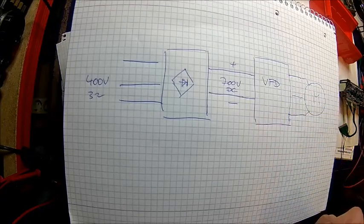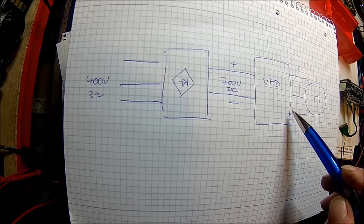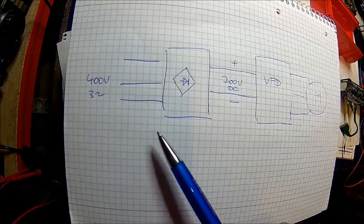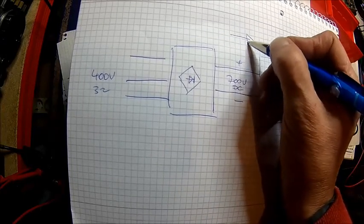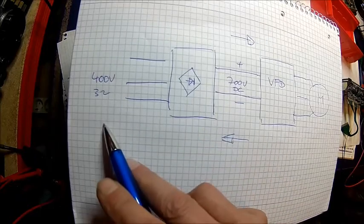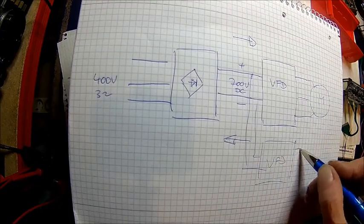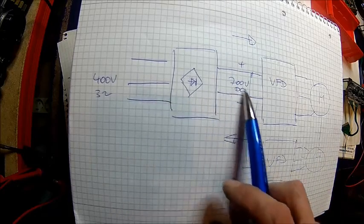On some drives you will find a B-plus or B-minus connector — this will be exactly the same. So this can be any drive which has access to the DC path. This one is a little bit different. Technically it's the same drive, but the software is usually very different because it's actually looking at the mains frequency and tries to push the power back. If this motor is driving something, the power flows in this direction; and if the motor is being driven by something, the power flows back to the mains. That's why you have this arrangement. You can also add another drive here with a second motor and just link that to the DC path.